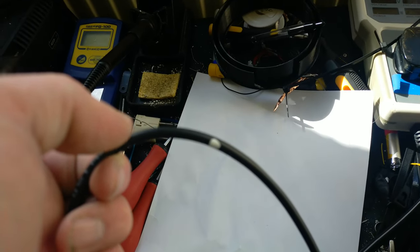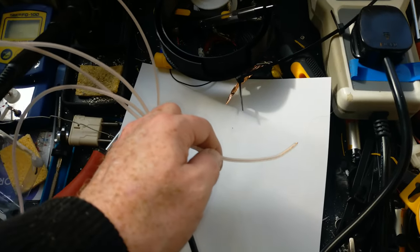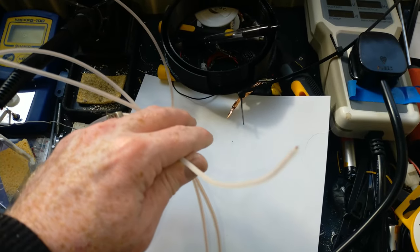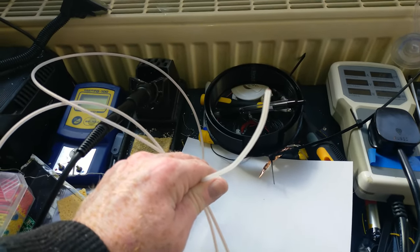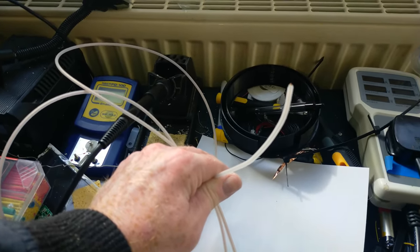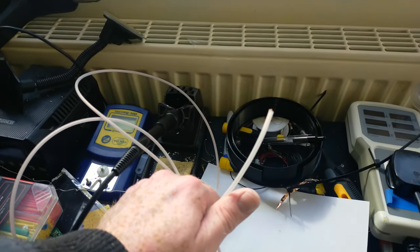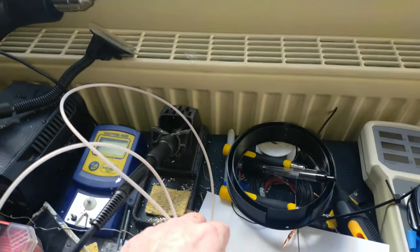I'll just pause whilst I show you the stripped part. This is the top section — the dielectric and the internal wire inside the coaxial cable. The top is slightly exposed, but I'm going to waterproof that. A bit of heat shrink on top should keep the moisture out. I might put a little hot melt glue on that as well, which should wick in and help keep the moisture out. That will be looped over to create a tuning loop for making sure it's resonant where it wants to be. Next job is to wind it onto the coil; I'm going to do that off camera.